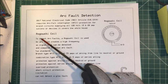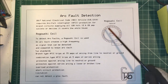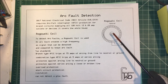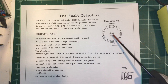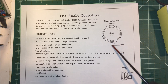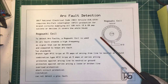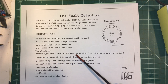How do they detect an arc? They use a Rogowski coil — it's a toroid that they wind around, then bring the wire back, and the current-carrying conductor goes through the center. When there's an arc fault, arcs produce a high frequency and this coil picks up that high frequency, brings it over to an ADC converter, and then compares it to known arcs — usually around one megahertz.